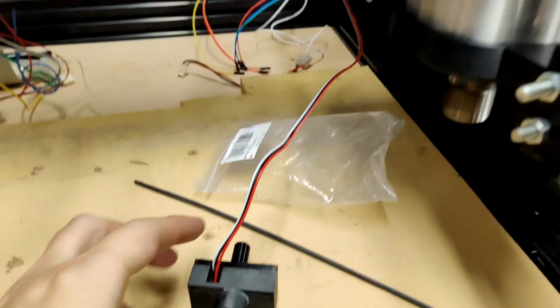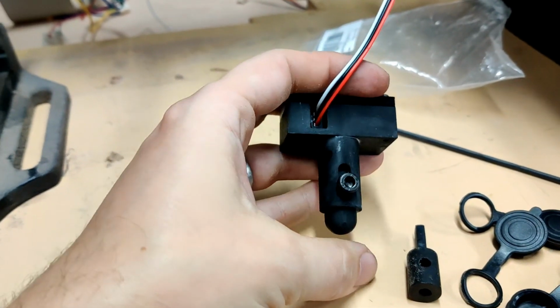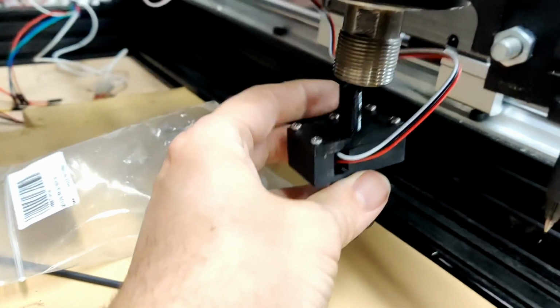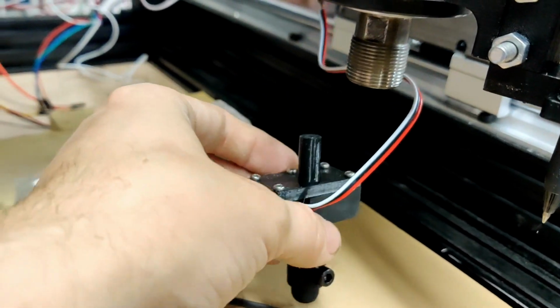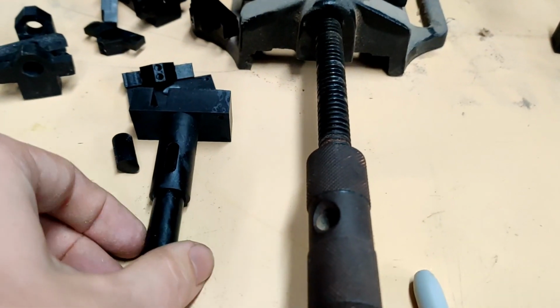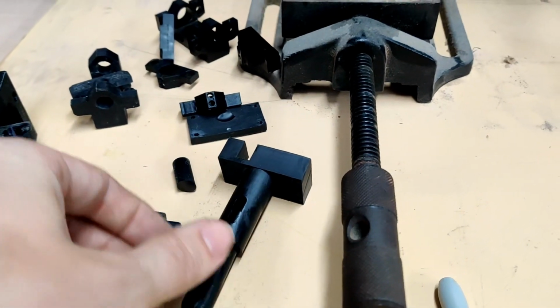And just a little spring so that this goes up and down, and when that goes up it pushes a block between the optical sensors. This was designed so that it would mount directly in a collet in the spindle, so it would be exactly on Z0. That works great. Again, there was an iteration. My first one was way longer than it needed to be.